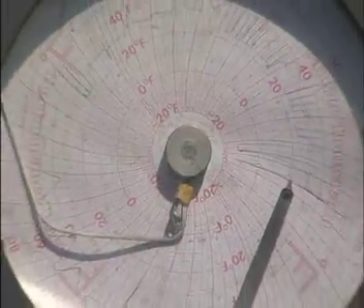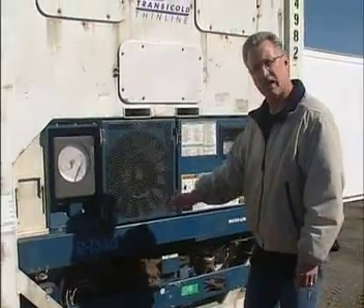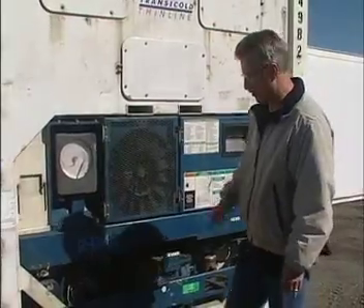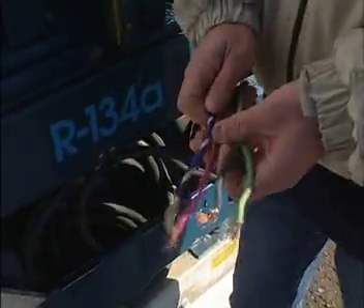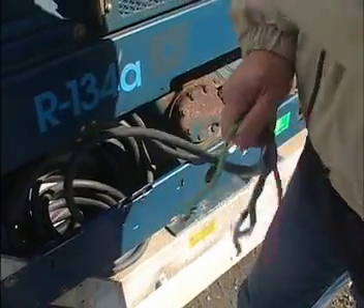That digital display should confirm against the chart recorder. Additionally, the unit has two different power connections normally: a 220-volt three-phase connection and a 440-volt three-phase connection. These are four-wire systems, and the unit itself can sense the phase rotation. A standard industrial or commercial electrician will know how to hook up a three-phase four-wire system — it's very simple.